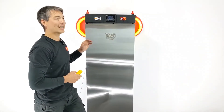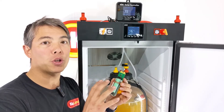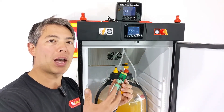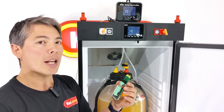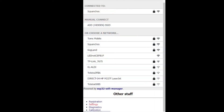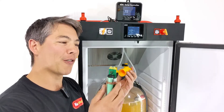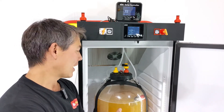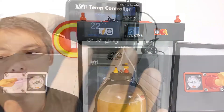First, you need to make sure the pill is emitting the Bluetooth beacon. By default the pill works in Wi-Fi mode. To switch it, plug in the USB-C power cable to force it into access point mode, then connect your mobile phone to that access point, go into settings, turn off Wi-Fi, and turn on Bluetooth. You need to do this before dropping it into your fermenter, because once it's in there you can't force it into access point mode.